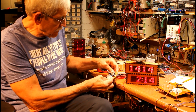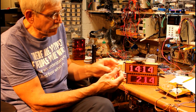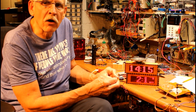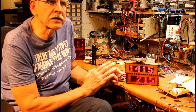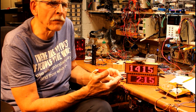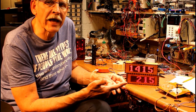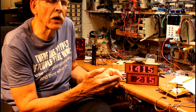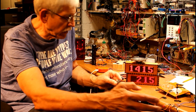In addition to the WeMOS and the LED display, there's a small device called a DF player — it's an MP3 player, not very big, about the size of the top of my thumb, and it has a micro SD card attached to it. All the files for the sounds are on that SD card. I found them on the internet and adjusted them a little bit using a program called Audacity. There are six files: one for the quarter after, one for 30 minutes after, one for 45 minutes after, and a longer one for on the hour. Then there are two different bong files — a short bong and one with a long tail that's the last one played in any sequence, so it kind of trails off when it's done.